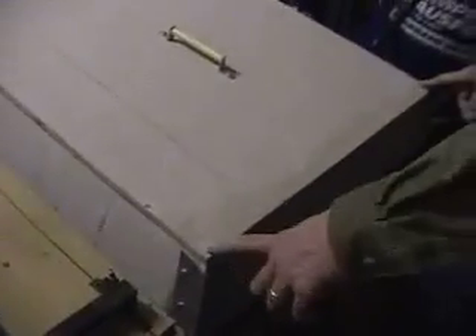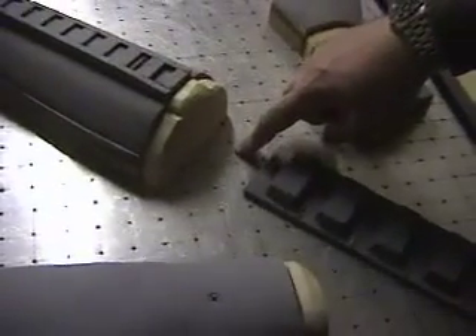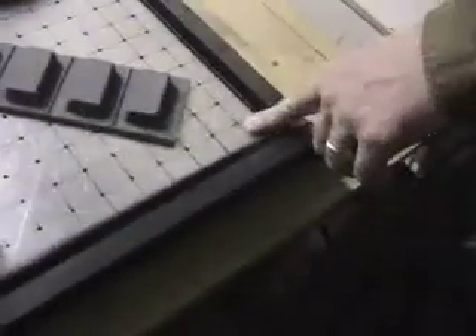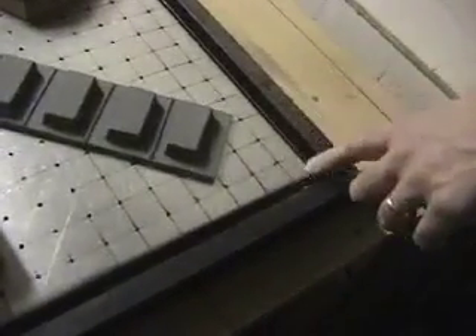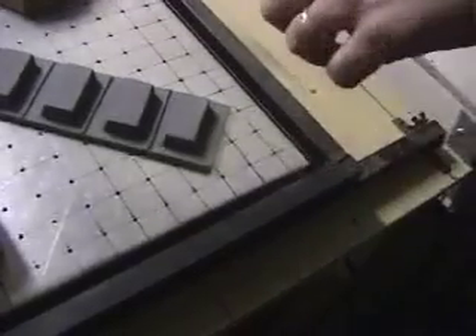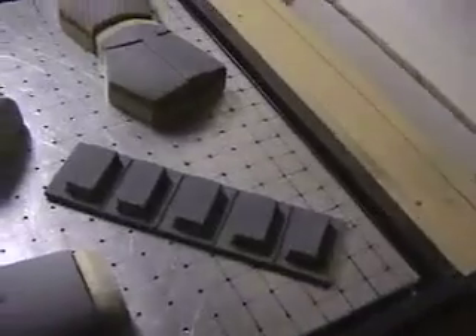It's a 28-inch base with a 24-inch top, which is the same size as our holder frame, which is the same size as our plastic. The corners are really the critical spot — it's real easy to get the center of your plastic nice and warm, but the corners are what you have to be really concerned with. They're going to be your cold spots, so you have to get your temperature up hot enough for your corners to make a good seal.